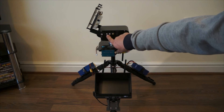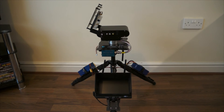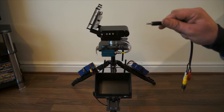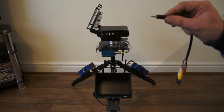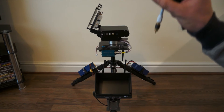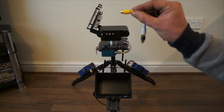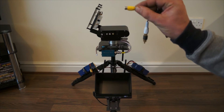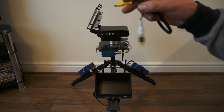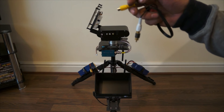The modification is fitting this socket here. It's a 3.5mm four-pole jack. The whole idea is that this plug is supposed to be able to twist no problem, so that gets rid of those stresses — whereas the RCA plug can go in but not move. It's not designed to rotate round in the slightest, so any stresses will be directed to the edge there or to the socket itself.